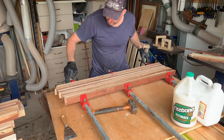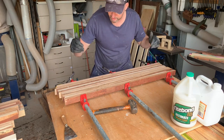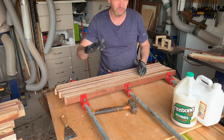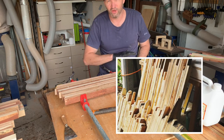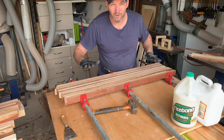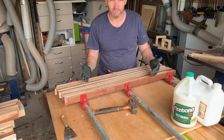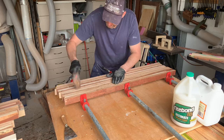Initially, don't over-tighten these clamps — just try and get it as flat as possible. I took the extra time in straightening both edges so it's actually pretty clean on both sides. If you go back to my previous video you'll see these things are all over the shop. The problem is they've then got to go through the thicknesser too many times, so spending more time on this now will save you on thicknesser blades, which are generally the most expensive item to replace. Okay, give it some love taps to get it nice and flat.